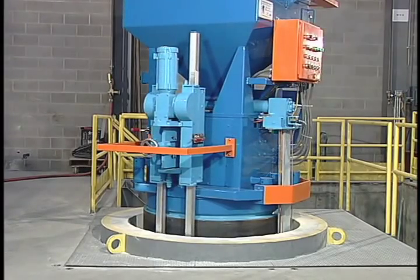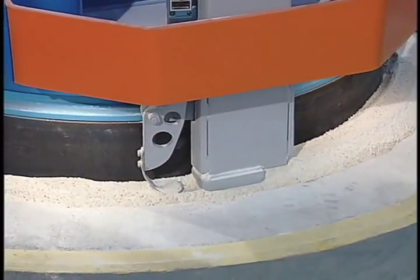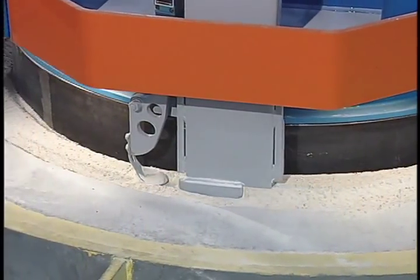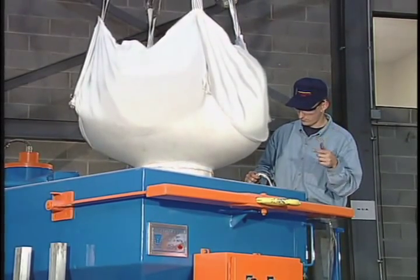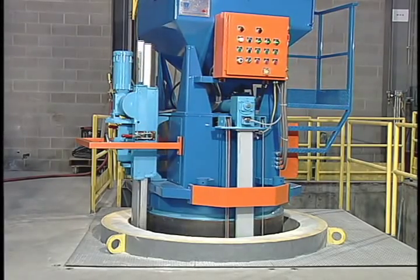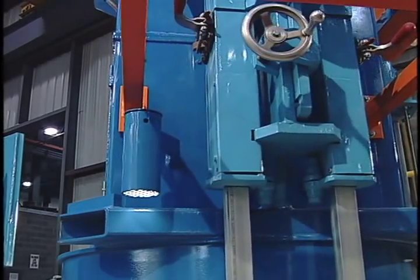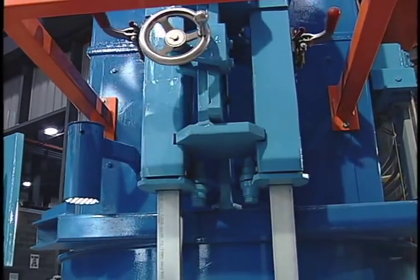Gradmatic's refractory installation system performs two functions. It dispenses dry refractory between the furnace wall and form continuously, using a retractable feeder tube. Dual forks automatically precompact, or fork the material. Once the hopper is filled with bulk bags of material, the machine is set to deliver about 2 inches of material per revolution, evenly and consistently. At the same time, dual precompaction forks deaerate the material at a rate of 600 to 700 strokes per revolution.